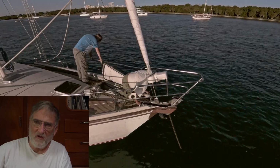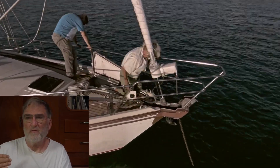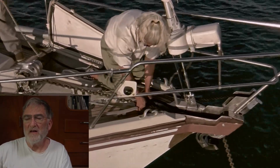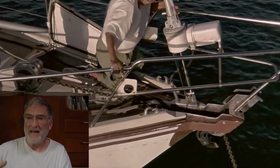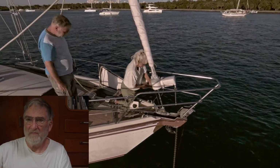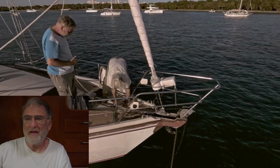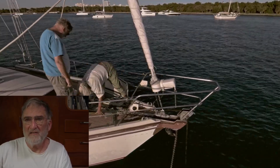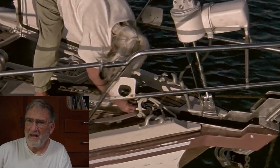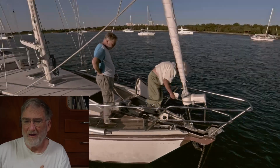The boat continues to drift back, and we let out enough chain that it hangs slack, and the snubber takes the load. Next step up here is to attach the chain hook, and again slack the chain so all the load is off the windlass. We'll later set the anchor alarm, and after a few minutes pull on the anchor with the engine to give it a bit of a test, but the bottom here is clear deep sand, so there's unlikely to be any issue. Now we can sleep well, anchored tight, in a good safe spot.